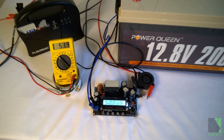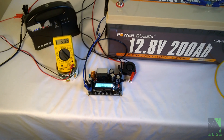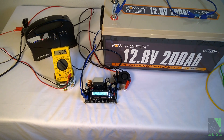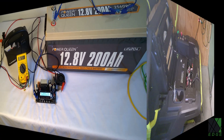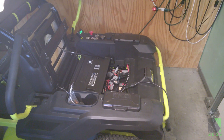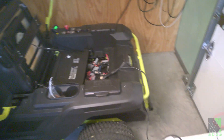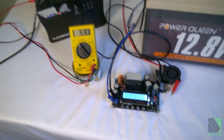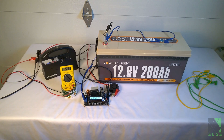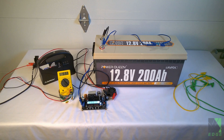Seems to be running well — about 80 watts. I don't really feel the need to push the setup too hard because it's a trickle charge, and as long as it does the job in a couple of days, I don't mind. I've been running this setup for a while now and it seems to be functioning well. As long as I keep the fan running it just gets a little bit warm — it's not hot, so it's not dangerous. The fan is taking care of the diode. Hope you guys enjoyed this brief demonstration of an emergency power setup for charging my 48 volt riding lawnmower. Thanks for watching — hope to see you next time.